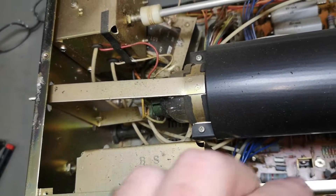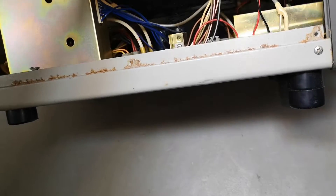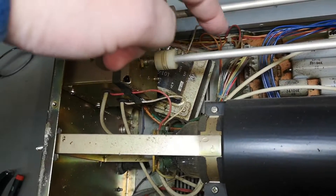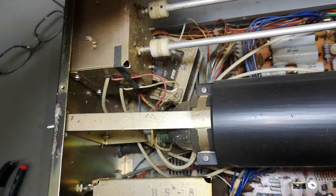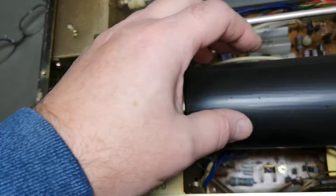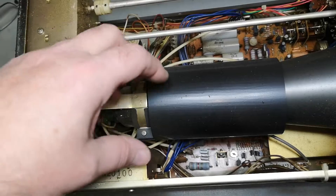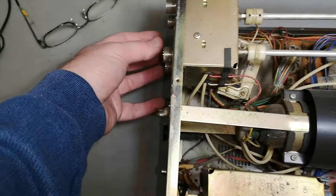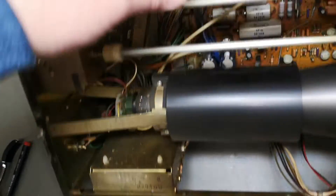I need to give this a little bit of compressed air, then it's going to be nice to work with. You can see the transformer is angled in a really weird angle - at first glance this looks weird, but the magnetic field of this transformer is obviously a problem to the CRT. So at this special angle the interference is as low as it can be. Otherwise you could put it at the back, but that would make the case bigger.